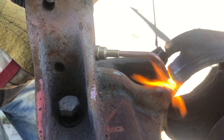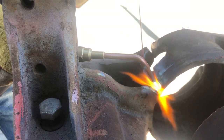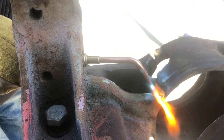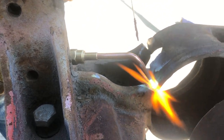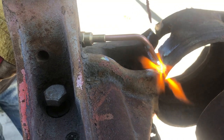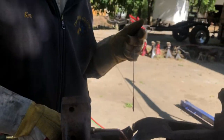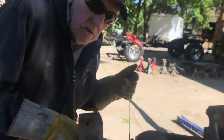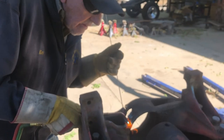And so, just to make it easier, when you don't know what the base metal is exactly, you get the different fluxes they have, there's about three of them, and just mix them all together. The one that is meant for that particular base metal will work. The other will just melt off. Burn up. So you don't have to constantly worry about which one to use. You just have a can with all of them in it, and whatever you don't need will burn away. That's right.